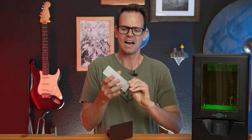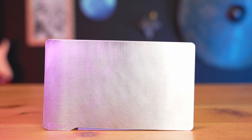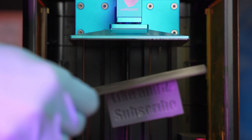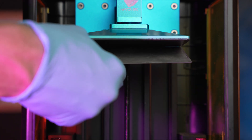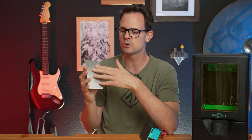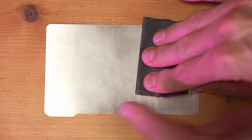These things are fabulous. I like the BQ ones because they don't have anything written on them that's going to end up showing up on the bottom of your prints, and they're pretty cheap, so you can buy two. That way, as you take one off, you can just slip another one on and start printing right away — you never even have to take out the plate, which means your alignment stays a little bit better. These are great if you print big flat things because you can just bend them and pop the prints off. I haven't had anything break once I started using the flex plate. One little tip: I like to take 180-grit sandpaper and sand the faces so there's a little bit more grip on there.